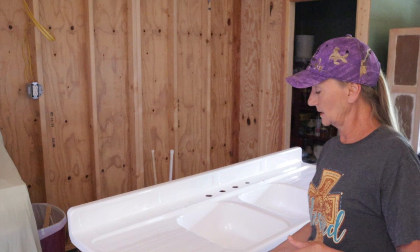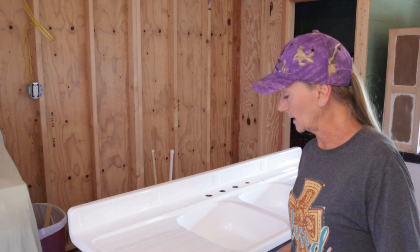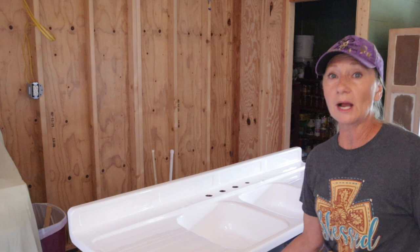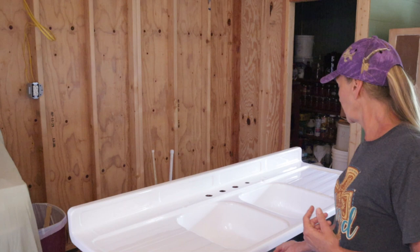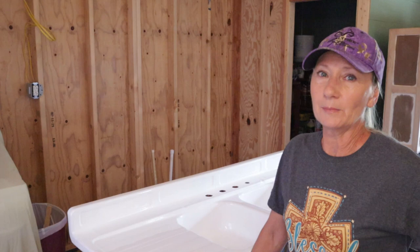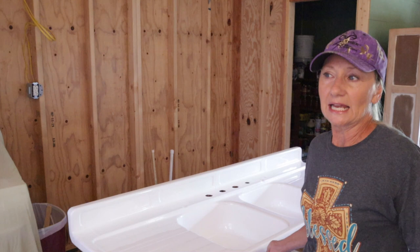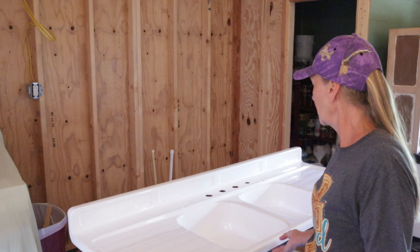Another tip: as the product is dripping down the edges, you want to take your scraper from time to time — I waited a while so some excess would already have dripped off — and wipe off the drips on the very bottom edge. I should have gone back one last time and done it again. To be honest, this had a working time of about 45 minutes and it took me probably 30 to 35 minutes. With the heat and humidity I was done — dripping wet — but I should have come back about another half hour later and done a final scrape on the bottom to smooth things out a little more.